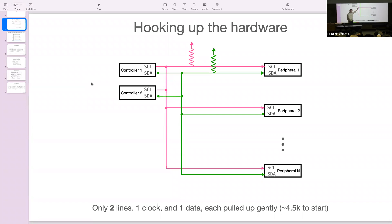You might call the reduced number of required IO ports an advantage of I2C over SPI. The speed is a disadvantage. I also find I2C a little bit trickier to debug on the scope — the timing diagrams are a bit less obviously readable than on SPI. Incidentally, each of your benches has two scopes: the regular scope and the little blue Pico scope, which is software controlled and has a serial decoder that can decode I2C waveforms into actual messages.